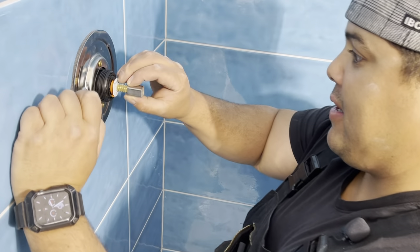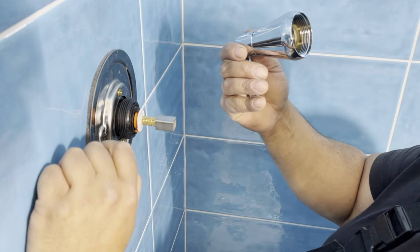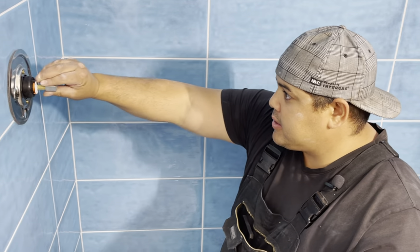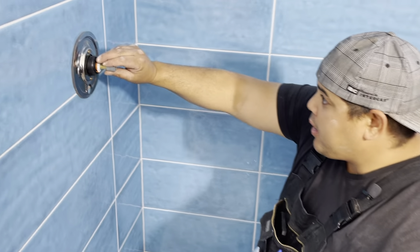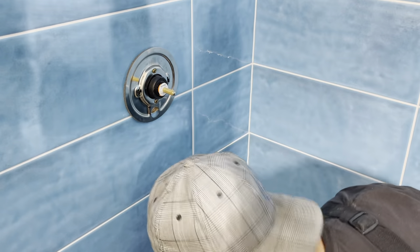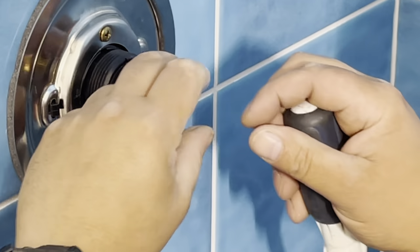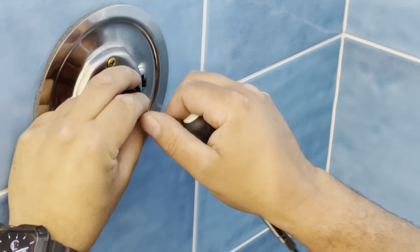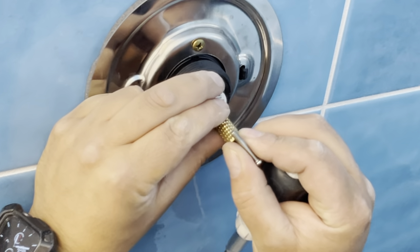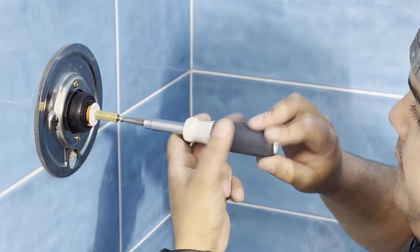This thing goes on like this. Now, looking at this and looking at the handle — it looks like the handle, that square part, lines up with the handle. So I'm going to want to have this in the off position, and you're going to want the handle to be aiming straight down. It looks like I'm off just a little bit. So we are going to unscrew this, and if you're doing this and you have a drain, just cover your drain up. We're going to pull this out and just turn it one notch like that. That's as close as we're going to get it.